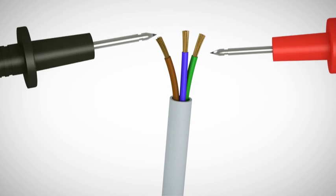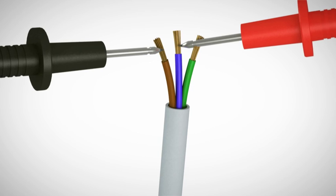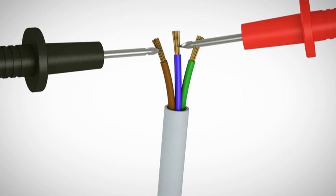Perform another multimeter test to check that the heater has not been damaged, and make a note of your reading in the Warmup installation manual. If your reading has changed, call Warmup immediately. Do not continue working. After completing the installation and testing of the heater, you will now be ready to install the floor sensor and connect the thermostat.